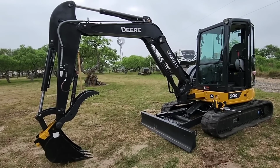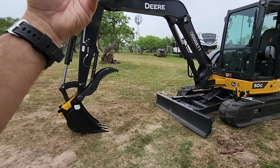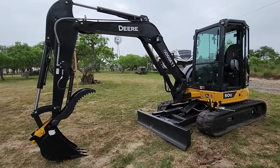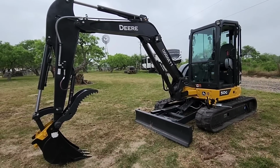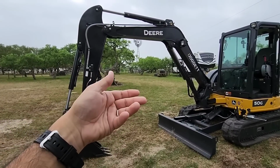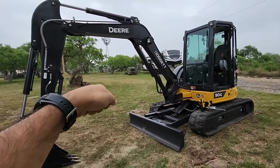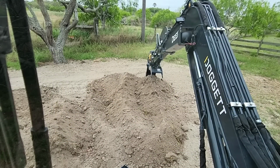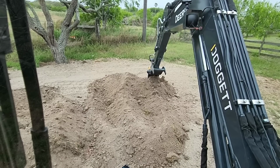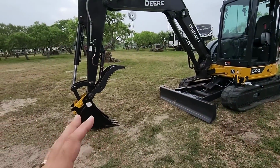The way I wanted to do it was the way that you eventually want to do it, where you essentially pull from the top and scoop out, which means you're operating both sticks at the same time, essentially 3 different planes at the same time, right? I have to move my boom in and up, pull my stick in, and curl the bucket at the same time. And as soon as you pass the fulcrum here, you have to push the boom back out, because this piece right here is going to go up as you scoop in, and then it's going to go back down. To be able to do that takes some concentration that I'm trying to figure out. I'm trying to work on it, because I'm getting a little better at it.